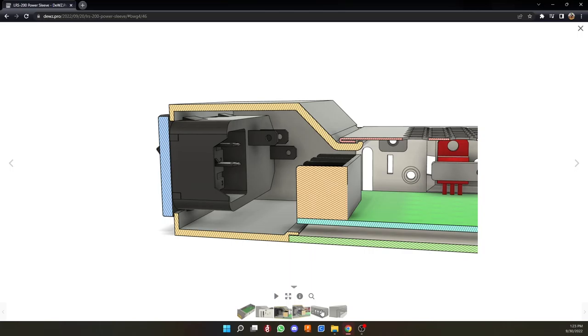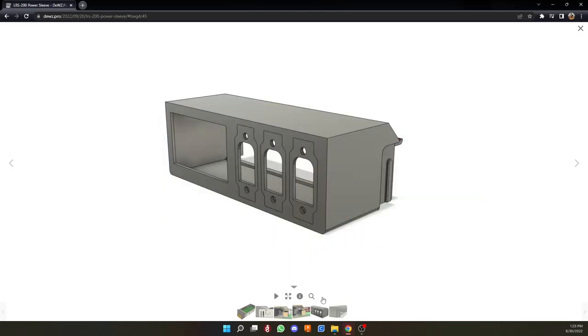And this is actually a slightly old image where we had a little lip right here, but it turns out that the Meanwell CAD file was different than what I actually got. So I modified the file, and I think it's gonna work just fine, but it'll have room for a standard, let's see here. We're gonna be using a C14 style plug with switch and fuse.